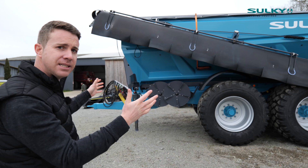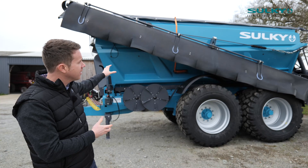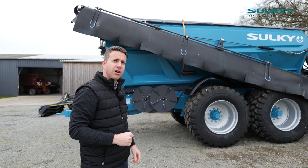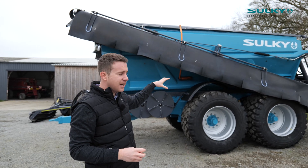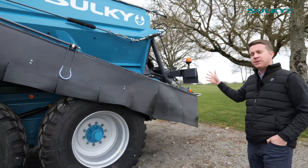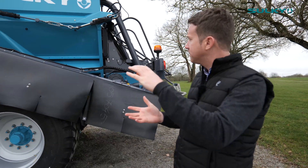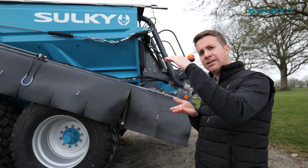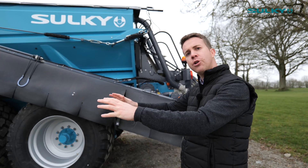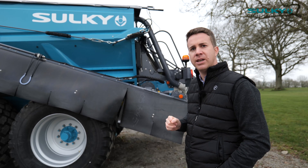The construction of the machine is very unique — it is much bigger at the front and narrower at the rear, making the system very smooth for unloading the tank. Inside we have a mechanical belt. It's a volumetric system. Volumetric spreader means that if the shutters at the back are at the right opening, the density is right, and the speed is constant, you always get the same volume of product going out of the machine, which makes perfect accuracy from a spreading rate point of view.